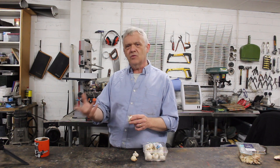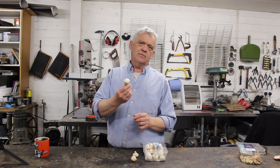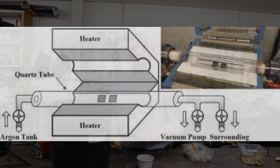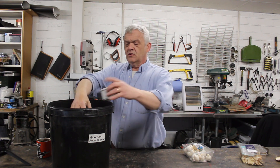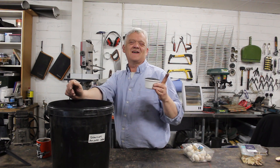Now in order to carbonize these without burning them away, we need to put them in a protective environment. Normally you'd use argon gas, but that's a bit difficult to arrange in a small home lab. So all I do is find a container — something that will cope with 700 to 800 degrees centigrade; this one will actually go up to 1000. Steel works just as well. Drop your material in, cover it with activated carbon, and you've created your protective environment.